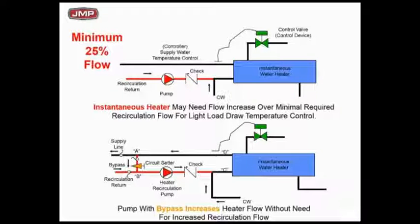Now if we go up to 25%, that one and a half GPM of cold water coming in is going to be mixing with a recirc pump bringing back warm water at 25 GPM. The sensor at the big control valve is now sensing a mixture of 25 GPM of hot water and one and a half GPM of cold water, so it's blended. Now it sees the actual temperature and can look at load better, because you've got a minimum flow rate of 25 GPM — not one and a half. That's the whole issue.